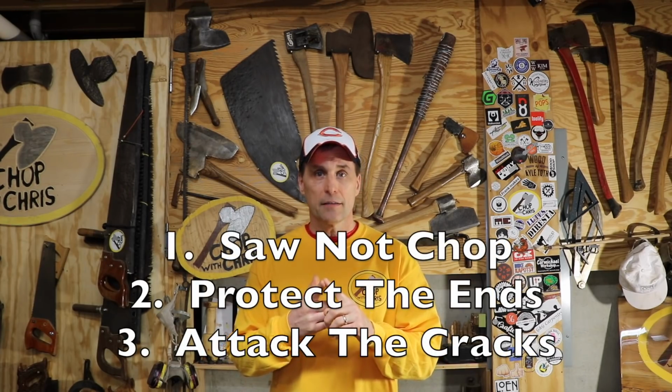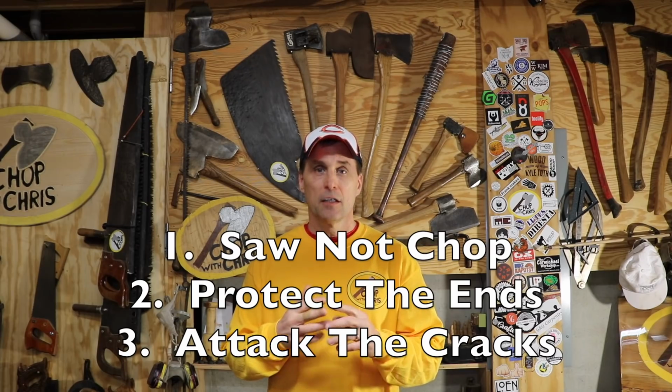There are three main techniques I'm going to focus on today. Saw not chop, protect the ends, and attack the cracks. You'll see this play out through the next four bowls.